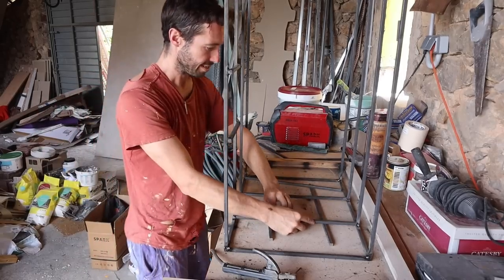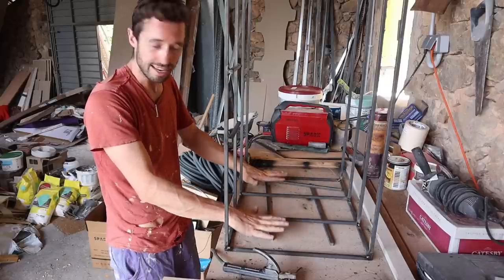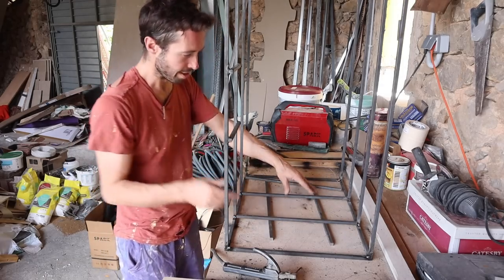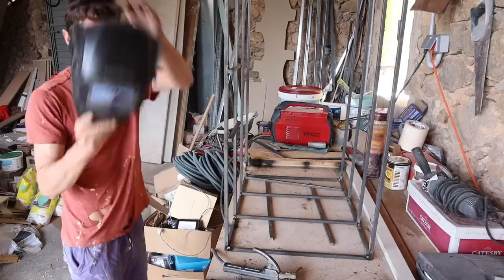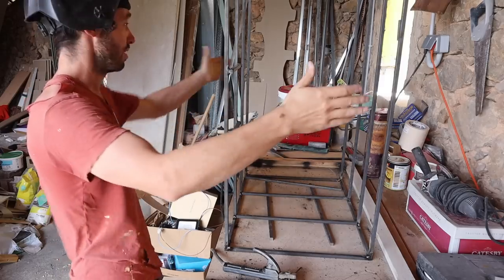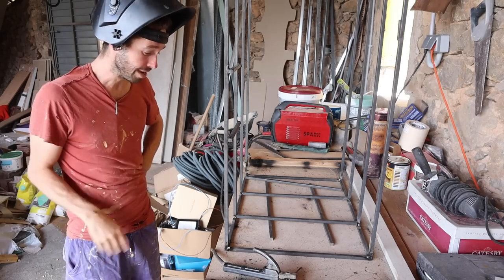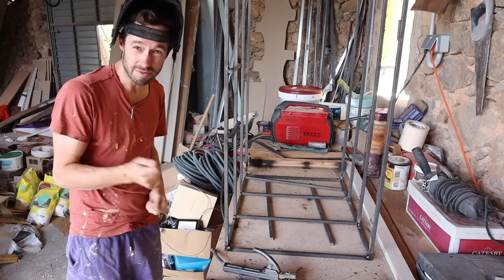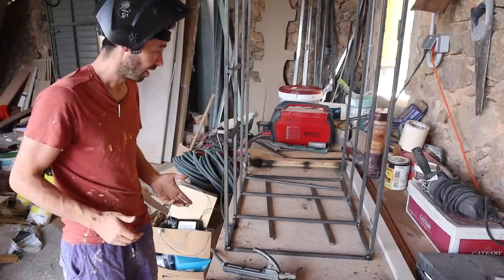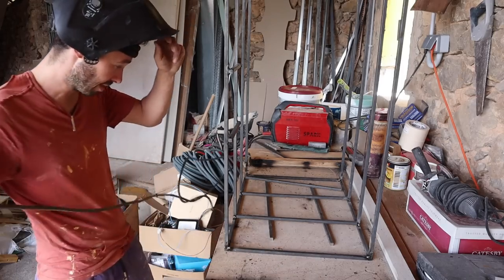Now I'm going to put in these cross bars, which will allow me to screw through the metal or adhere some panels on each side. I've put a couple of bits underneath so I'm now one centimeter up — I'll weld those in, then do the same on the other side. All that's really left in the structure is some stuff for the lower shelf, a divider and a cross beam, then the welding is more or less done. I'll grind it all down — it's a cover so it doesn't have to be insanely strong. I'm just going to weld these little ones in.